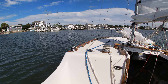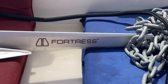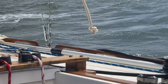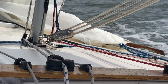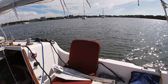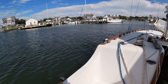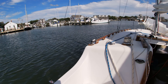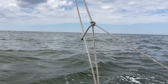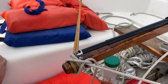I arrived in Ocracoke Harbor and was looking for a place to anchor. I had already assembled my bigger Fortress anchor in the mud position. I routed the anchor line forward around the outside of the shrouds to the bow, through the bow rail, and then back to the stern under the jib sheet to the cockpit where I tied off the bitter end. This is a big anchor that stores in five pieces and is bolted together, but I was able to assemble and route it before arrival.